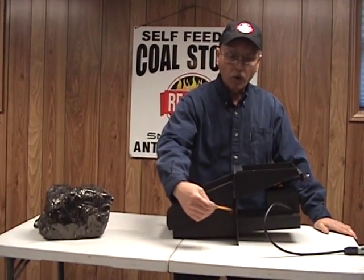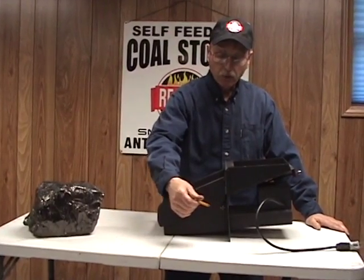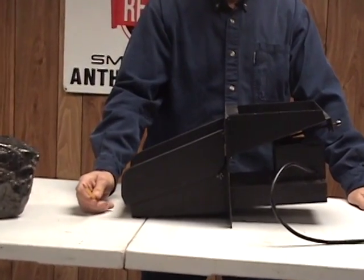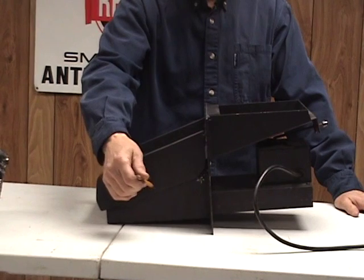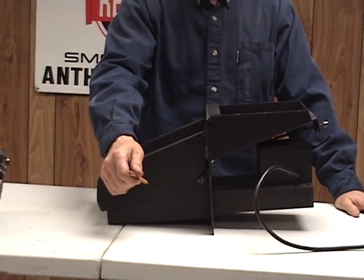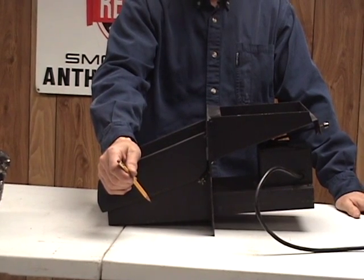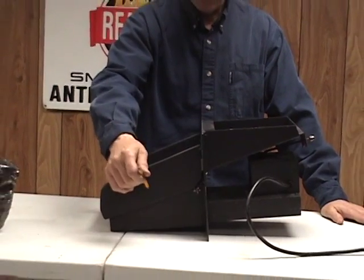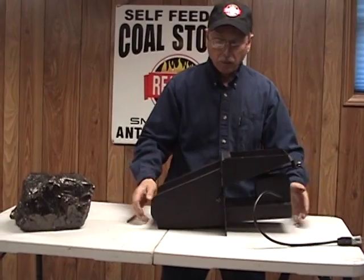One winter is not going to cause you a problem, but if you don't clean it out every year in the spring, eventually you'll accumulate enough fly ash and fine coal in that air chamber to cut off the airflow. And obviously, if you cut off the airflow, your burner's not going to work very good. So to show you how to clean underneath this burner in the spring when you shut it down, what's involved